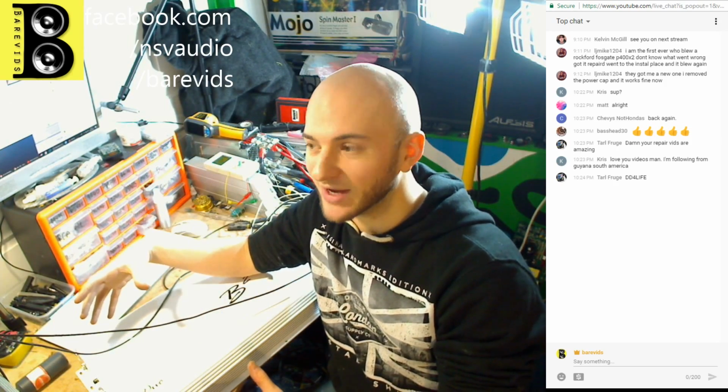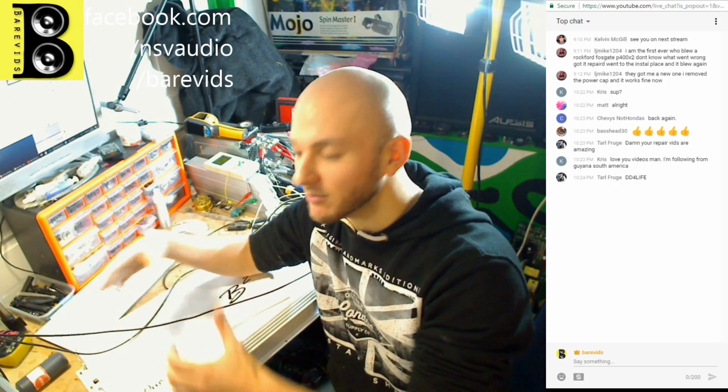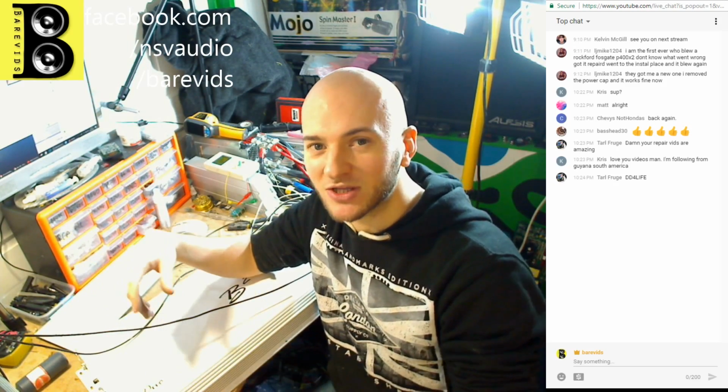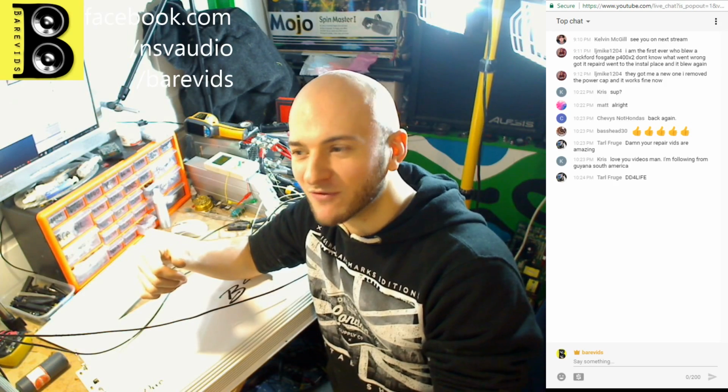And so when I got this amplifier in, I powered it up on my 9.8 volt supply, and it showed the same issue that the dealer said was the issue with the amplifier. It didn't power up, no lights, no protection, no nothing, completely dead. And so we took it apart and started doing a repair on it, and it did 2 hours worth of repair. And someone in the chat suggested, you know, try connecting a 12 volt supply just to see.